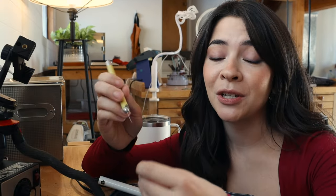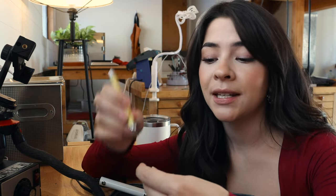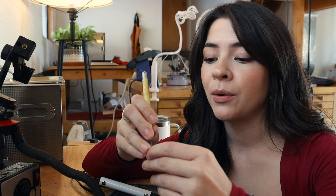When you cast your piece, you're gonna be sitting there drilling and drilling and drilling, trying to dig out enough metal to get your stone in, and you're gonna wear down your burrs, waste time, and any wax that you get away from your stone would end up, how do I say this? Any excess wax that you remove before casting would have been excess metal, which would have cost you money. So make sure that you carve away any wax that's going over your stone.